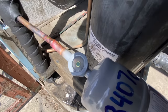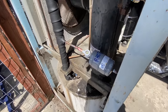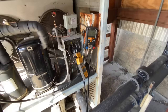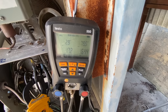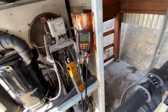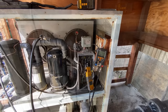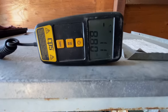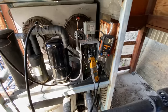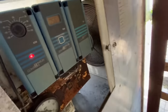We're still flashing big time. But we're getting pretty close. Yeah, that dropped us down. See, that dropped our evaporator pressure way down. So let's see, that turned off. I probably wanted to shut off a little sooner. All right, we got our charge about where we're gonna be at for right now, about 11 pounds, 8 ounces. And the second fan's about ready to cycle off again shortly here. And our chilled water's coming down to 56 degrees.